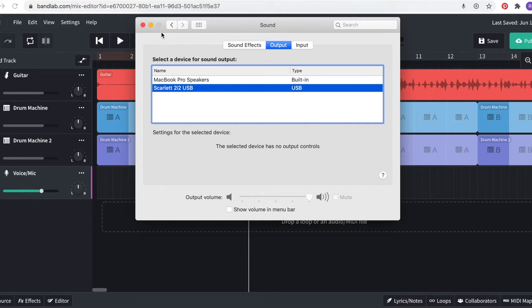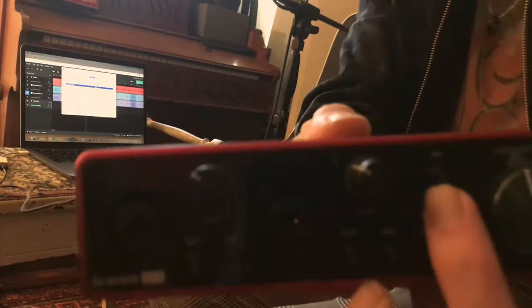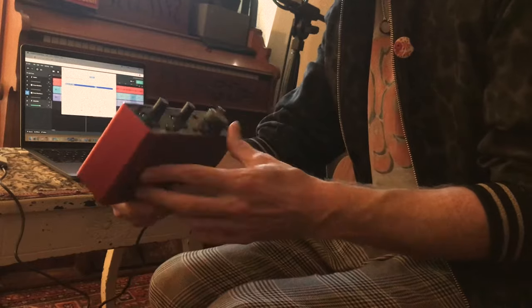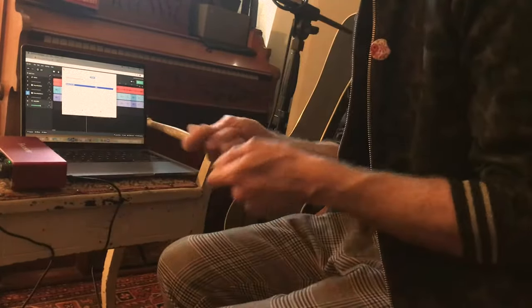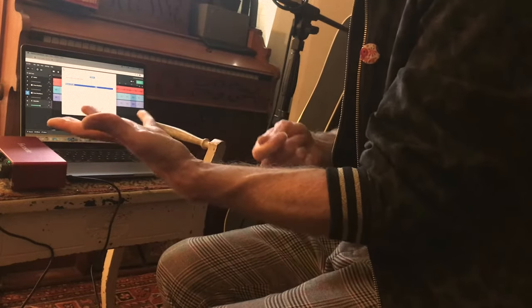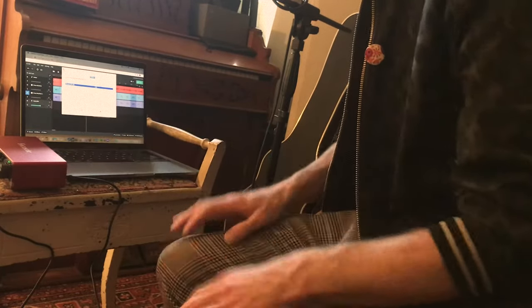So that should now be the microphone set up. This mic that you've all been given requires what's called phantom power — it requires power from the USB. This button here, 48V it says, that's phantom power. And to get this microphone working, you're also going to have to turn phantom power on. Just make sure you don't plug or unplug the mic while phantom power is on — always make sure the mic's plugged in, then you turn phantom power on, and turn phantom power off again before you unplug the mic. That will just look after the mic.